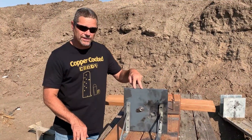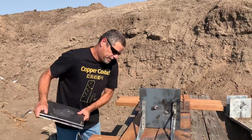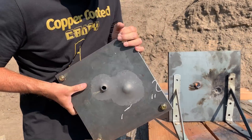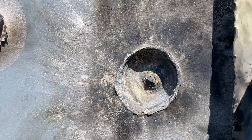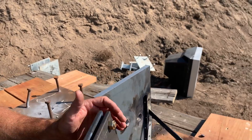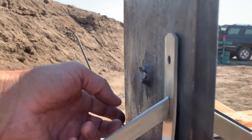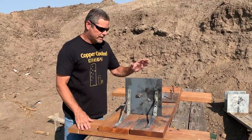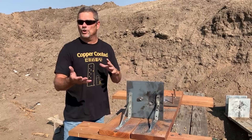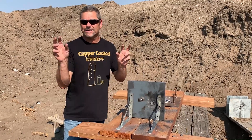Alright, so we're going to put the three quarter inch plate back up, shoot it with an incendiary round, and show you what happens. Once again, the three quarter inch solid mild steel proved to be stronger than the dual three-eighths spaced steel. There was a bulge on the backside of the spaced steel, and the entrance made an odd cone and ball shape. On the backside of the solid plate, there's actually less of a bulge. A solid piece is better, of the same type of steel.